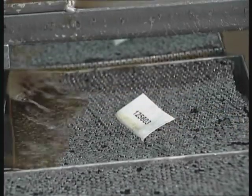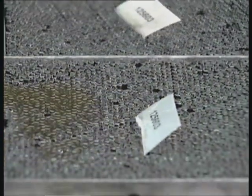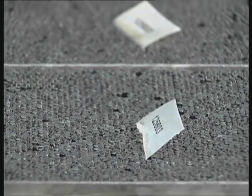Out of the drying chamber and into the kiln, the leads are fired at a high temperature, resulting in a complete fusion of the clay and graphite. The leads are subsequently impregnated in a hot wax bath, to ensure that they later glide smoothly over paper without scratching. A characteristic typical of Staedtler pencils, and a feature for which they are well known.